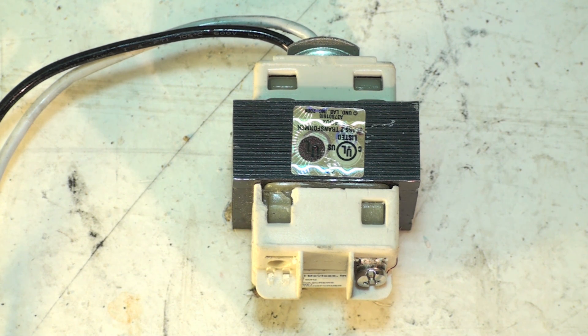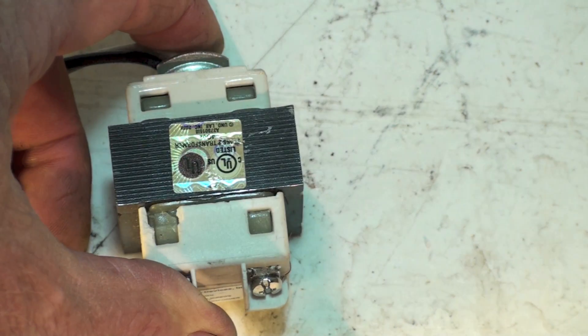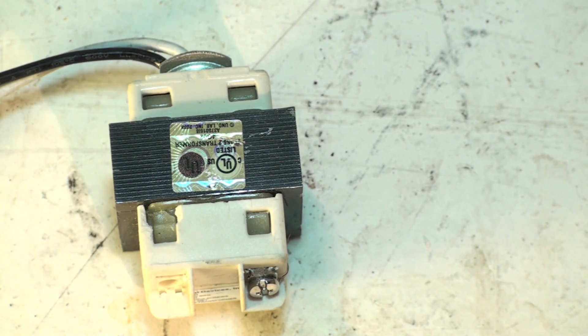Some transformers have multiple voltage taps, meaning several different tap points so different numbers of windings are in the circuit for different voltages. This simple one is just a single tap — cheap and useful. We need them virtually any time we want to change voltage with AC. The big transformers on substations work the same way. They're usually step-down, but they can be step-up: put 12 volts into the secondary and you'd get 120 out of the primary. As long as that winding ratio is maintained, you'll get specific voltages out.